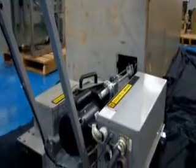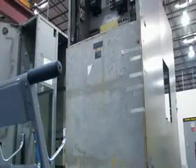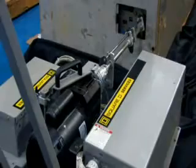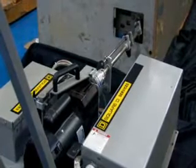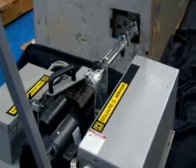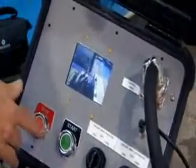For circuit breakers that have a rotary-style racking system, such as ITE Type HK or Westinghouse Type DH breakers, Square D Services provides a portable racking cart and remote operating station, which can be mobilized to connect the existing manual racking system of any breaker in one or more switchgear lineups. A portable remote operating station is provided as part of the system.